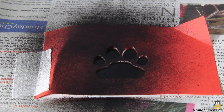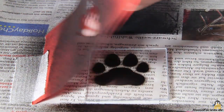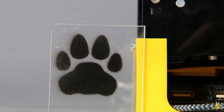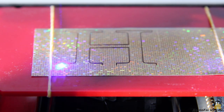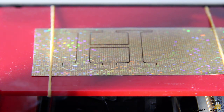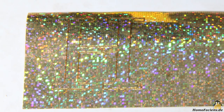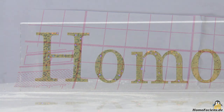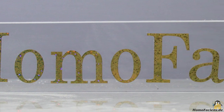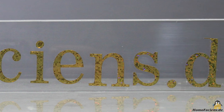You can cut out templates for lacquering. Recording a video while doing paintwork is tricky, but the result isn't that bad. Adhesive films can also be cut out with the laser beam — here I am processing the first character of a lettering. After about 7 minutes the first character is cut out. The machine parameters must be selected so that the laser cuts through the adhesive film while the underlying paper is kept intact. Good results were achieved with a laser power of 70% and a burn time of 35ms. The whole lettering is about 35mm high and 360mm long.